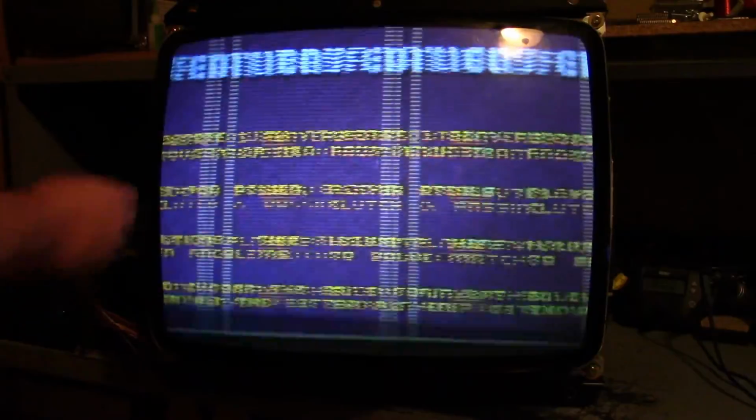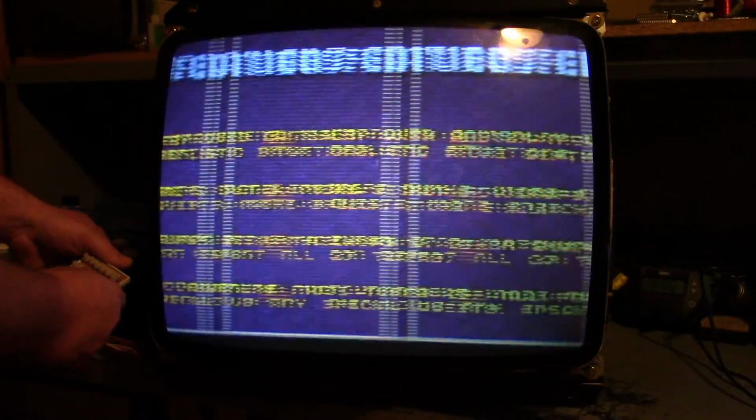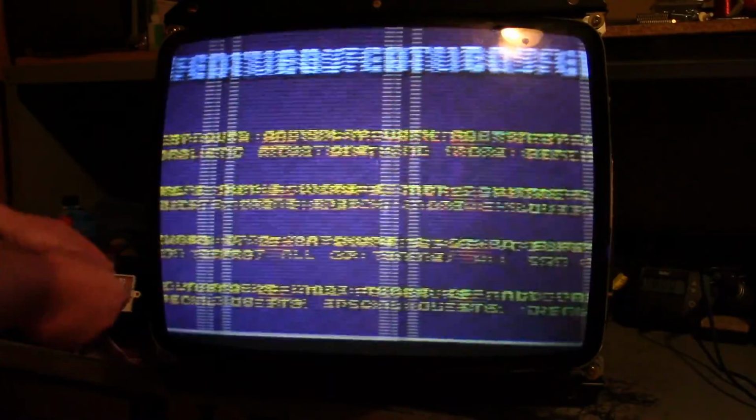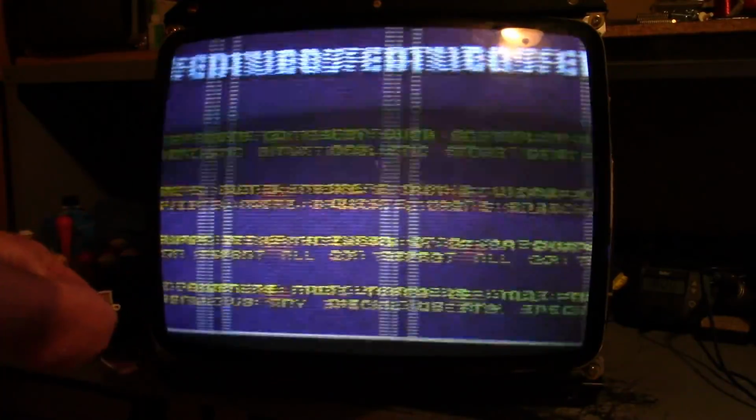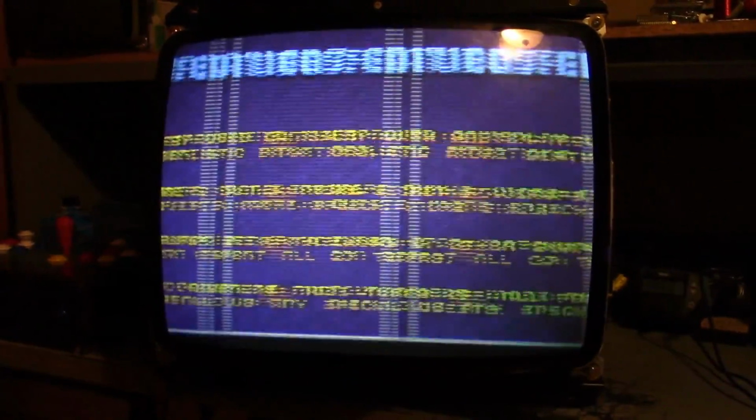And this is supposedly a standard res monitor. So our holds are dialed in. It's not a hold problem because we have a stable image. It's just kind of doubled and messed up. So, well, looks like further troubleshooting is required. Stand by.